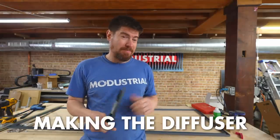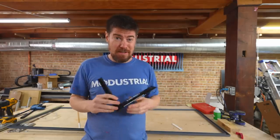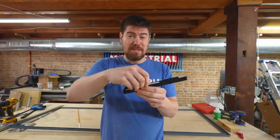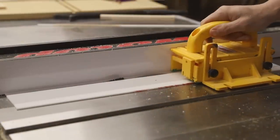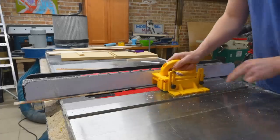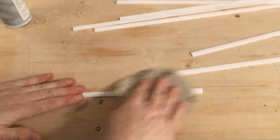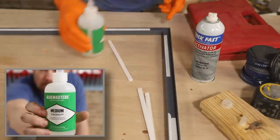Before we put the final coat of paint on and put the LEDs in, we've got to make the LED diffuser out of acrylic. We're going to cut strips of acrylic on the table saw. There are little strips that I've super glued to the side which serve as a ledge to rest the diffuser piece on at the right height. I'll cut the diffuser piece at the table saw, gradually making it thinner until it's a nice, tight pressure fit. Once I had the pressure fit dialed in, I repeated the process for the entire fixture, then used CA glue to attach the support strips to the inside, with a light sanding first so the CA glue adheres better to the smooth acrylic.